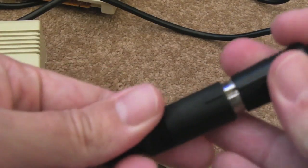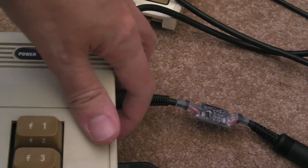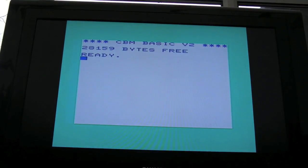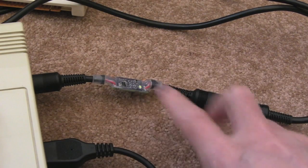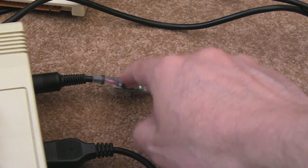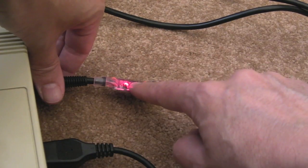I'll show you how I noticed the switch bounce. If you connect it to the system first, switch the system on, then plug the power in and just watch the LED: it's green, it's red, it's working. So that's what it is — it's the switch bounce. If you've got one of these from Hans, that's all it's going to be. You can use this — this workaround will work for your system. If you've found that problem with your particular power supply, just try using it that way. It will work; you don't need to bin it or send it back. You can see it does it again when you switch it off — you get the spike there when you switch it off.